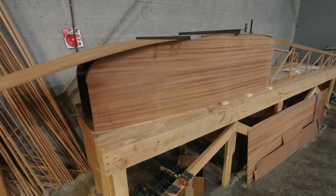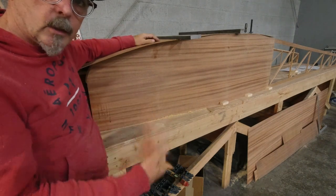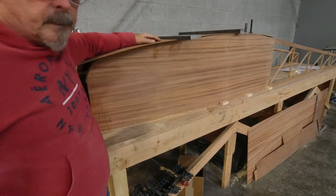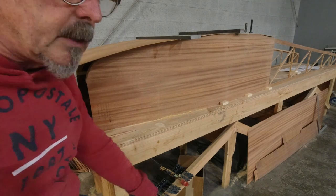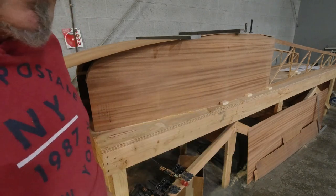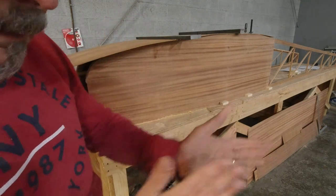All right, now we can take it off and cut it, and I can actually leave all the lines just a little bit proud, because I'll just come back with a flush router and trim all the edges, so that's much easier than trying to get a perfect cut and end up cutting off too little. So let me get this off, get to the bandsaw, and I'll get this cut.